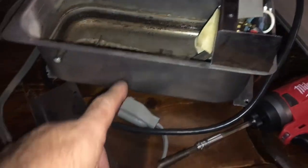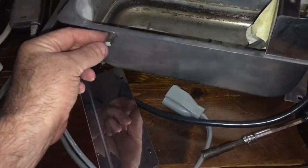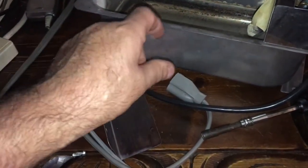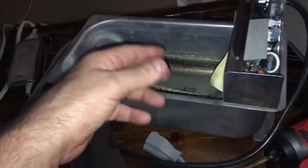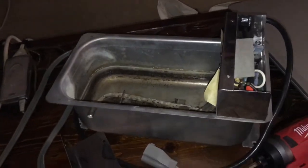Give me your comments if you guys have ever put two pans under a unit. What I was gonna do is use this old pan, jump it out, and put a tube from this one to the other old pan — same as this one — and just join them together with a piece of rubber tube. So if this one fills up, it'll go into the other one. Run dual pans. Let me know what you guys think about that idea.